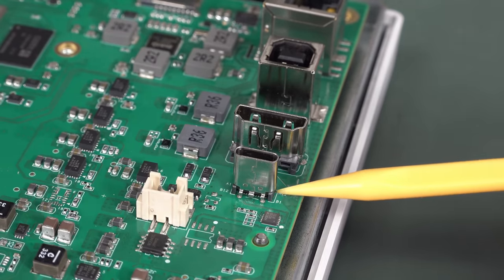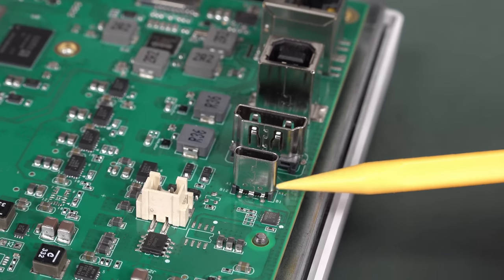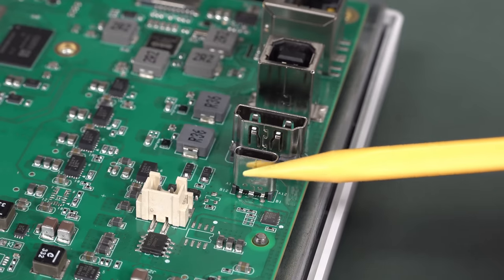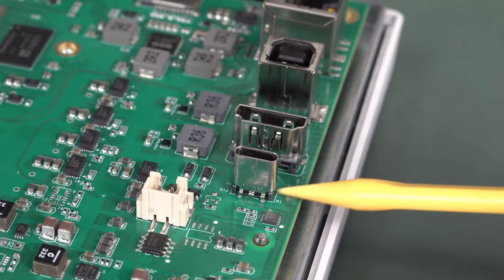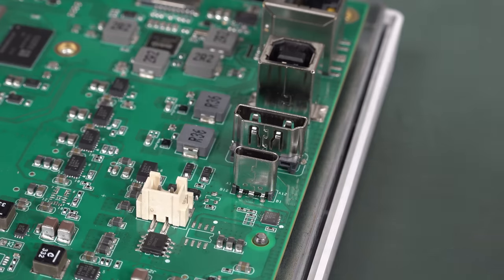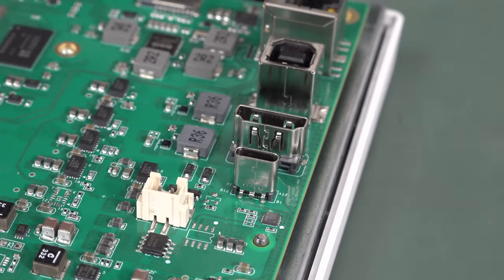Now, one thing many people wanted to see is the USB-C interface. Yes, it is soldered directly down on the board — it's not on its own little daughter board. So if you wiggle it, it could break off. That's one of the weak points of the design. But for the cost reduction, I guess it's acceptable. But if you start ripping pads off your USB-C interface, you're going to be in a bit of a spot of bother. There's no alternative way to power this.